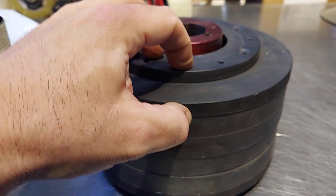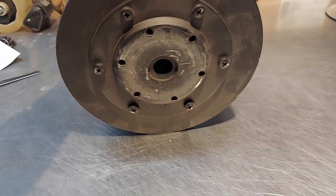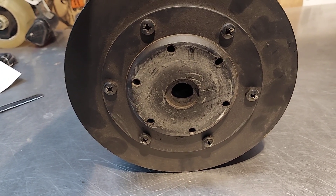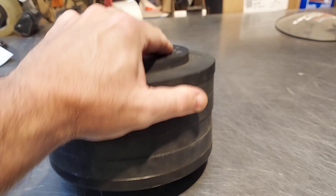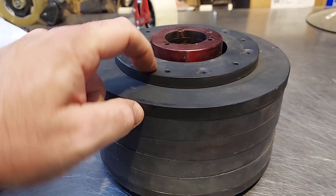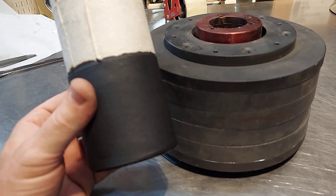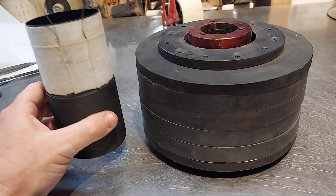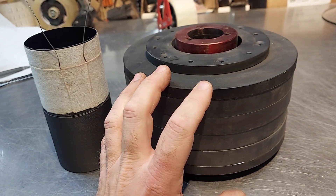Sometimes they'll vent the sides and the top plate to keep it cool. This one is actually a modification — I think this is the Majestic two-and-a-half inch, kind of a piece-of-shit 12 inch, with this pole piece bolted on. I stacked four big magnets on it, then a two-piece top plate and zapped the whole thing — now it's awesome. That's the only reason coils burn: when they're out of the gap. Ambient temperature also matters — here in Arizona it gets hot in a car.